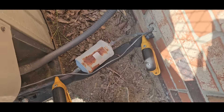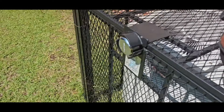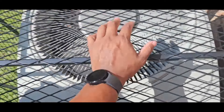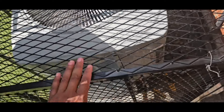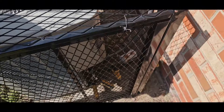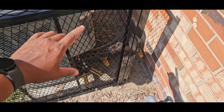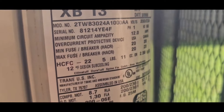I don't think anything's wrong indoors. It was running but it just shut off after I got my clamps on there. It's pretty difficult to get the low side and high side on — I hate these cages and they've never given us a master key for the locks. For all of this property management's properties with these cages, I normally have to cut or grind or saw the lock off. When I immediately hooked up the gauges before it cut off, it had 94 psi on the suction and about 320 on the head — this is an R22 unit.